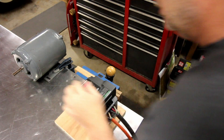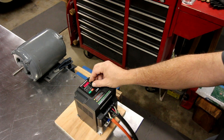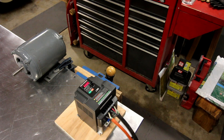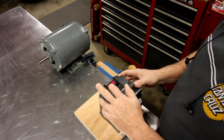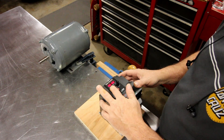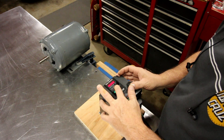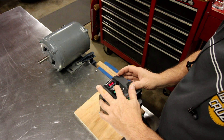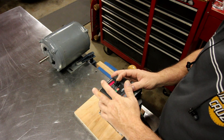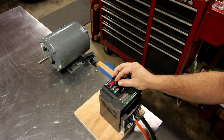This is with the carrier mode set to two-thirds — the carrier frequency is set to five kilohertz and you can audibly hear the frequency in the motor. I mentioned I should be able to run this motor at 120 Hertz, and really the only thing keeping you from doing that is mechanical. When I push it to 120 I can feel a vibration developing on the housing of the motor. When I back it down to about 105 or 106 that goes away, so to be safe I just pushed it down to 100 and I don't feel any abnormal vibration through the whole range.